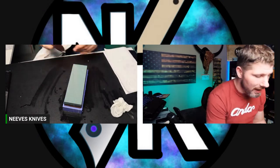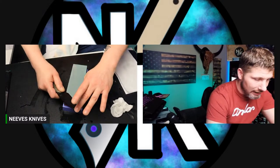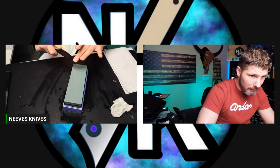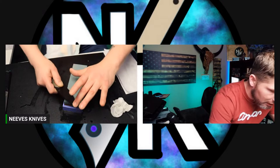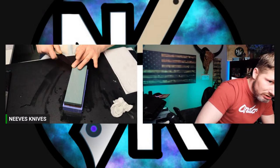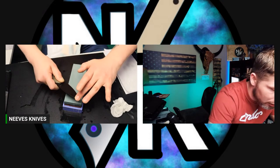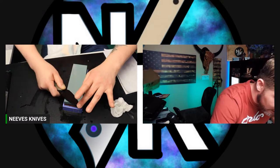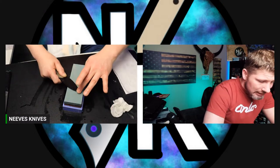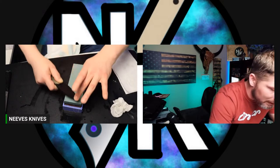So when you go back and forth a lot, you want to lock your wrist. If you look at me right here, when I lift off of the stone, so when I come across like this, now when I lift up to go back over here, watch how I do it. I'm keeping my wrist locked. I'm using my elbow to lift up. All I did is when I pick up, my wrist is still locked in that same position. So when I set it down, it should hit the exact same spot, or at least very close to it. That gives you a better ability to pick the knife up and set it back down.